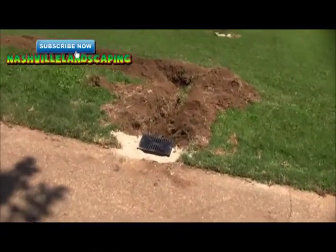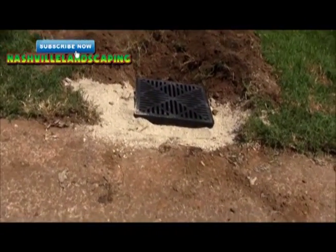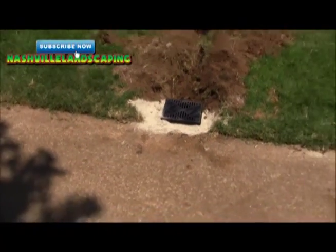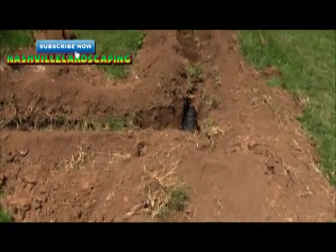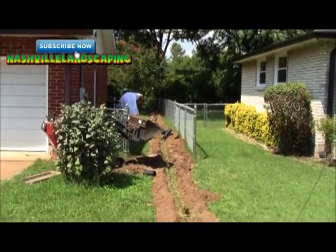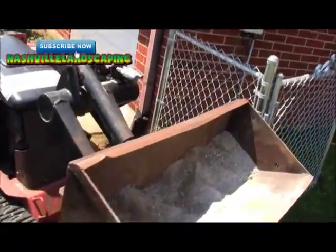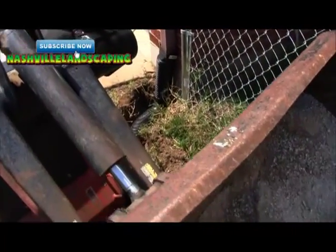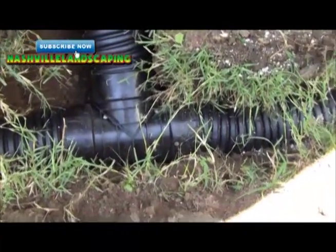Let's take a look around and see how things are going. We've been working a while. We've got the drain boxes in and we've got most of the pipe run. So right here we've got one drain box just off the driveway and it's actually lower than the driveway. When the water pools on the driveway, it'll fall off into that drain. This drain connects to this pipe which goes all the way back to a drainage area in the back. We've also connected this downspout to the downspout right in there. It runs right under this machine and connects in with that T that I showed you earlier.